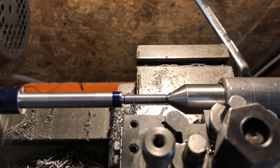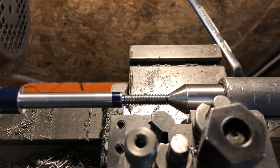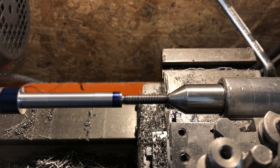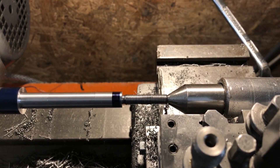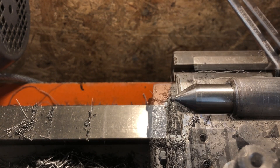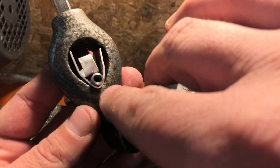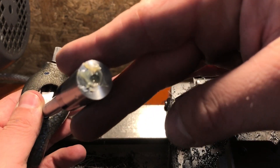Once the thread is close to book depth I'm periodically removing the part to check the fit on my test piece, being very careful to return the dog to the same jaw on the chuck each time — you only make that mistake once. As soon as I feel the test piece begin to thread on, a couple of spring passes gives a nice fit, and a quick fettle with a file and fine wet and dry completes the thread. To continue the work I flip the part with the dog clamped onto the thread using a shim of protective aluminium on both the dog and screw side, with a dab of grease in the opposite centre.